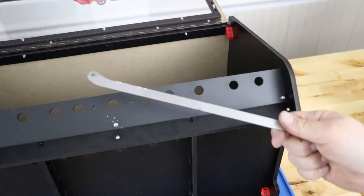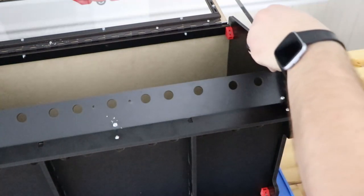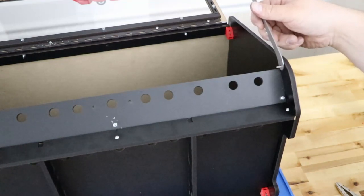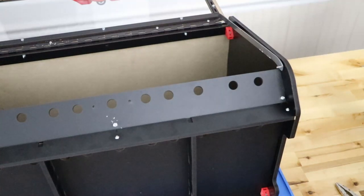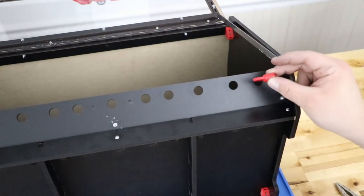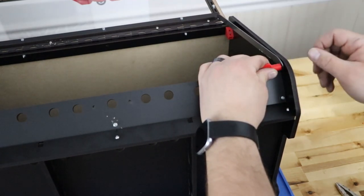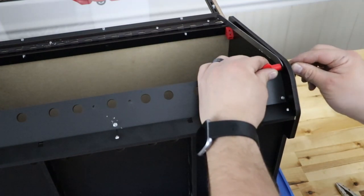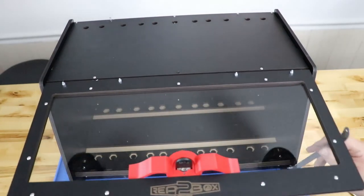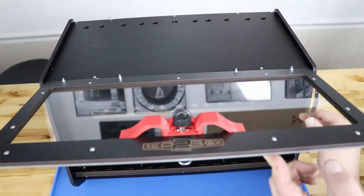Next, install the doorstop. Push a screw through the screw hole, then install the doorstop with the tabs facing down. Grab a nylock nut, get it started, then use the included tool and Allen wrench to tighten — just snug enough for a little friction, not super tight, because this part needs to move. The doorstop swings up, and when you pull it out it stops right in the little slot inside the door panel.